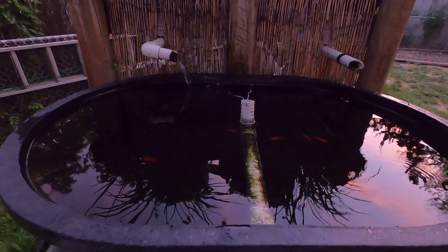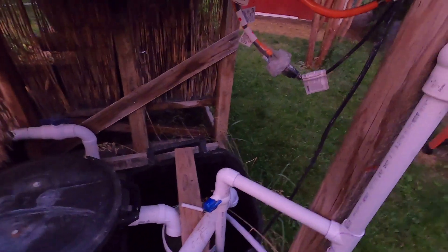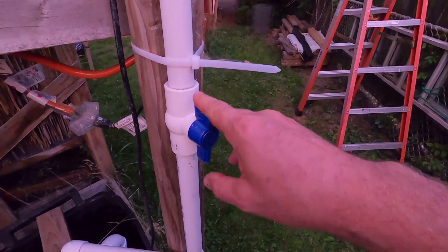This one is a little slow. The other thing you've got to watch out for is you need to have fall when the water comes out — if you have just a straight-down pipe, it'll never break the siphon. I learned that the hard way.